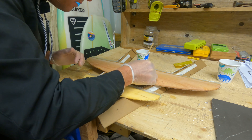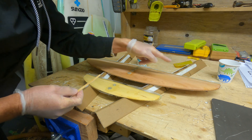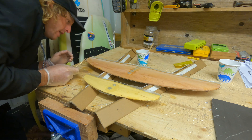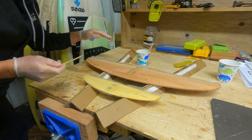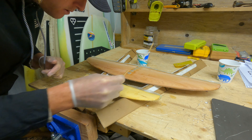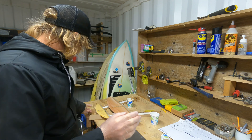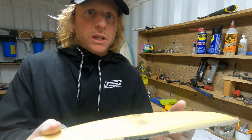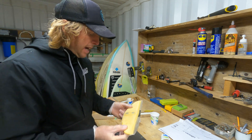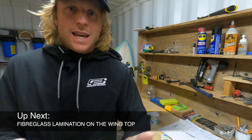That looks pretty done to me. One thing to double check is that after it's been sitting a little while, you check along the trailing edge to make sure there's no run. That looks pretty good — I think it's going to sand nice and flat. We've definitely got ample build-up on the holes. So now we've got the resin filled in the holes and on the trailing edge — that is done for the day. We'll let that set overnight for 24 hours, then come back, clean it up, and get ready for the top lamination. That's it for today and I'll pick up again tomorrow.